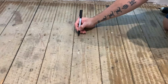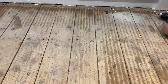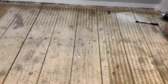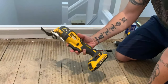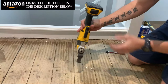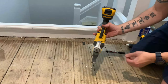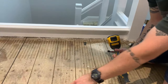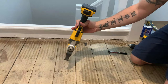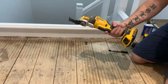I want to cut fairly close to the nail heads, about there. There are a few methods I could use. If you've got a multi-tool, it's a brilliant bit of kit and I could use that to cut along that line, but there's no depth stop on it. So if there was a pipe or something running along there, chances are you'd nick the pipe and cause a leak, or catch a wire. I try to avoid them if I can, but they are brilliant for other things.